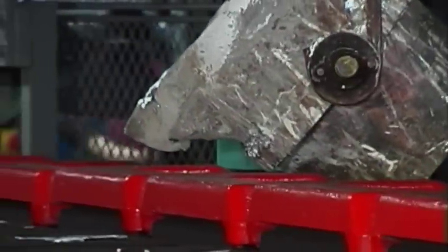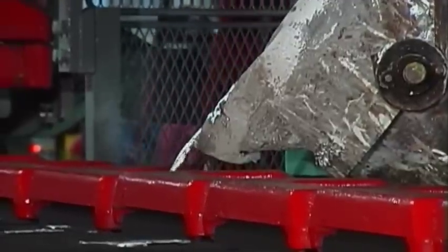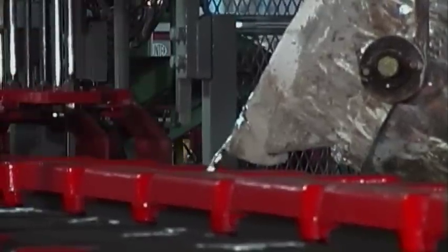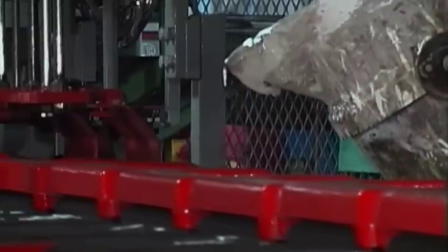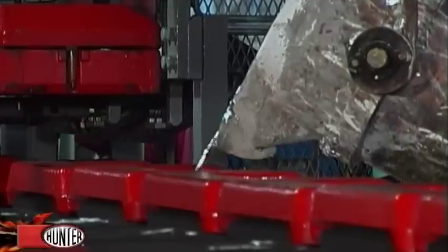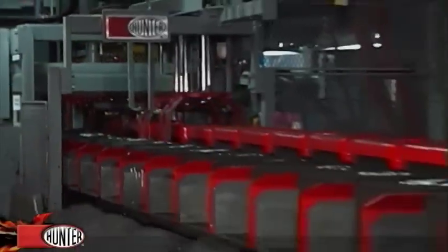Begin pouring at the far end of the pouring line, moving the ladle towards the transfer station as each mold is poured. Upon completion of pouring this mold, an indicator is raised on the last mold car poured. The system is switched to reload. The pouring line then reloads with unpoured molds from the accumulating conveyor until the mold with the indicator raised reaches a proximity switch at the far end of the system and waits for the pourer to return.